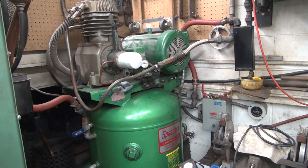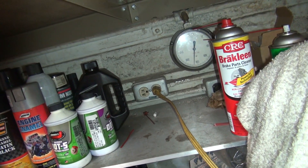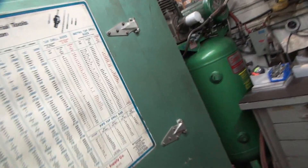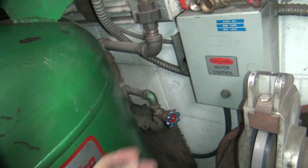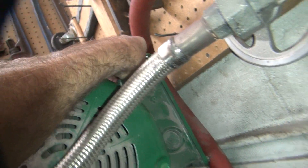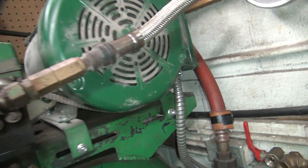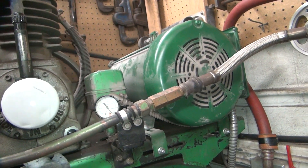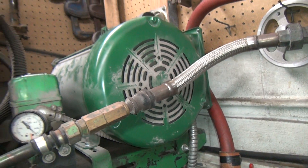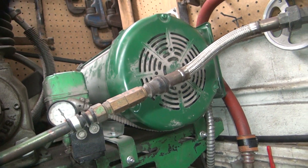The problem is if you don't deal with it, it can only get worse. The compressor shut off — it usually shuts off at 180 or 166, but right now I went over to shut everything down and I see my gauge is over the red line. I'm going to flip this off. It wouldn't snap, so she's still trying to run. The circuit breaker is not popping anymore — looks like it overheated or something. It popped while it was running.